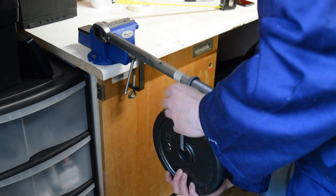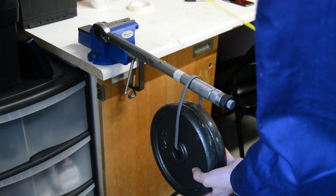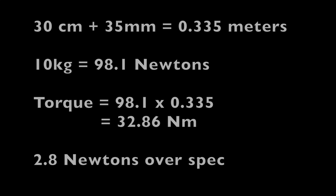Make the noise. The phrase 'make the noise' and all derivatives thereof are probably trademarks of Bad Obsession Motorsports. If you haven't already, be sure to check them out on YouTube for some professional quality tea drinking and occasional four-wheel-drive mini building. So that extra 35mm equates to another 2.8Nm. Well, I'm pleasantly surprised by that result. For a cheap torque wrench that's probably about 10 years old, it's still accurate to about five or ten percent, which isn't bad. The test wasn't the most scientific, but at least I know it's not wildly inaccurate and it's still suitable for use.